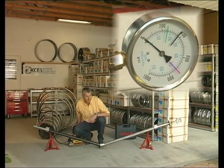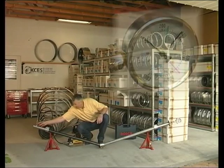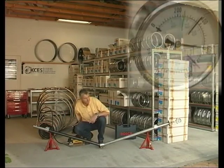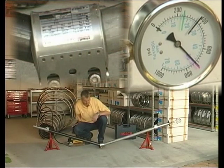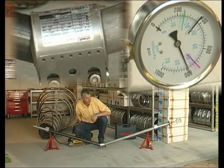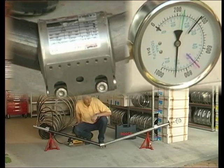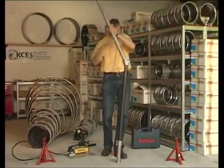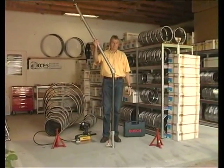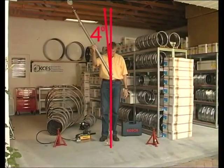This has occurred because the distortion of the join has resulted in an increase in volume within the pipe. When the pressure test is redone, there is absolutely no evidence of any leak, even when we apply a pressure of 1,000 psi. It can be seen from this demonstration that the angular deflection is in fact significantly larger than 4 degrees.